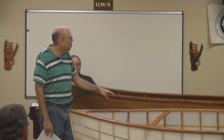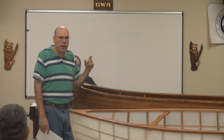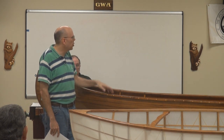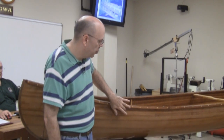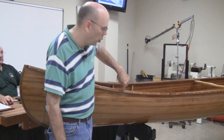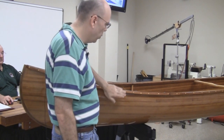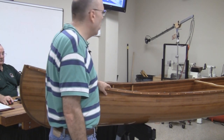I used a variety of homemade clamps and masking tape, because you don't need a lot of strength pushing the strips together — just enough to get a nice bond and control the squeeze-out. The bottom of each strip has the cove and the next one nestles in on top — that's how you make the transition on the curve. The beginning strips were not an issue, but as you start making this transition it allows the curve to work. I had to fair and smooth it out. It took me a couple of weeks to do that.